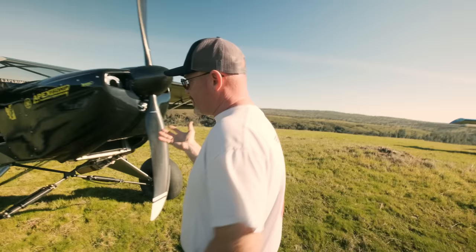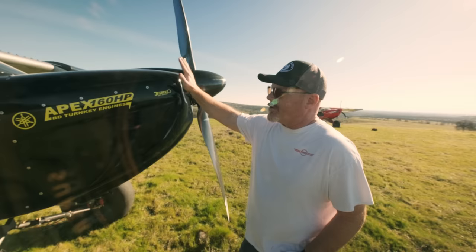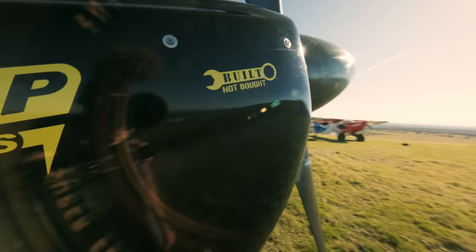So my favorite cowling on a Kitfox was from the early Model 5. They called it the short cowl. It was a Rotax cowling, and it has this body line, this bump on it. And so I got one of those, but it was too short for this application. So I took the Model 7 boot cowl and kind of made it work with the Model 5, made a mold, and I carried that body line into the boot cowl. Probably would never do it again, but it's super light. The whole thing weighs like 7 pounds, so it's pretty awesome.